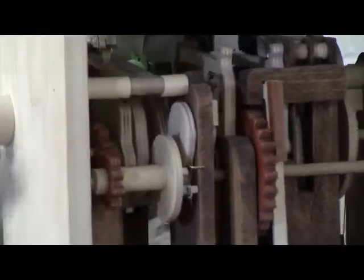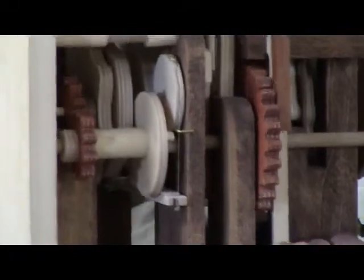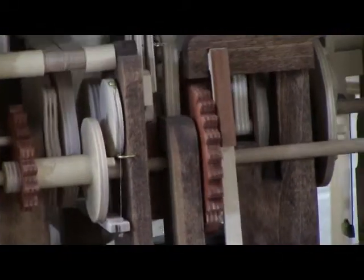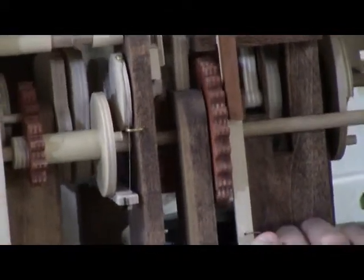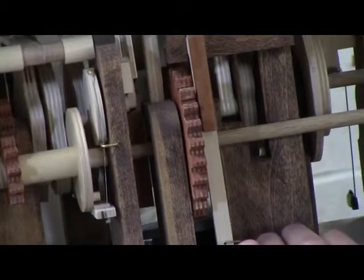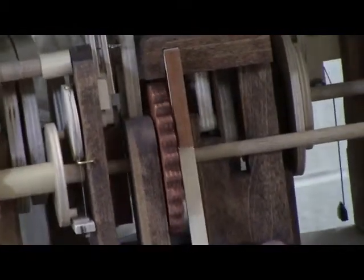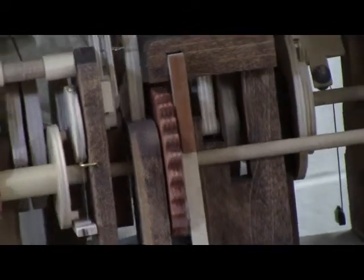There's a Geneva mechanism on this thing that makes that wheel turn only every once in a while. And I'm trying to look down through the crack in the dock so I can see it start to turn, but I'm wiggling around. It's wiggling, okay? So it actually pulls that lever. It's up against the pin now. See that pin coming down there? This time, that pin's going to keep that lever from coming up. Okay, so it's trying to pull, then it stops.